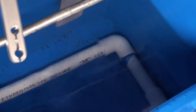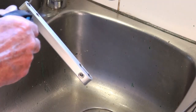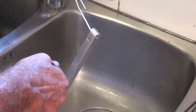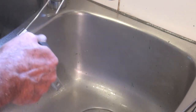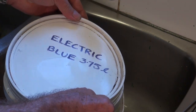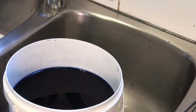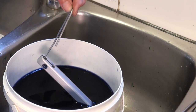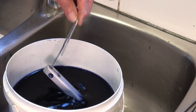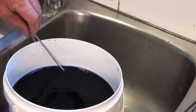That's been in there for about an hour and a half now. When it comes out it should have a slightly greenish-yellow cast to it, which is the anodised layer. The rinsing here is just to ensure you don't contaminate the dye bath. The dye I'm using is a Caswell Australia product — this one's called Electric Blue, also available from Caswell in the US. It takes between 10 and 20 minutes depending on the depth of anodising on the part.